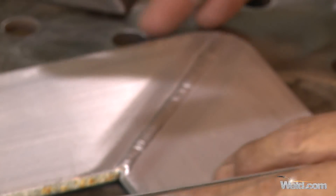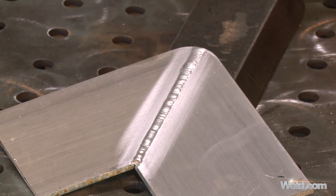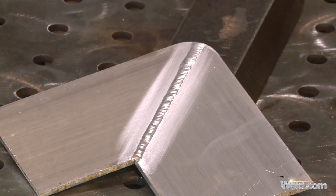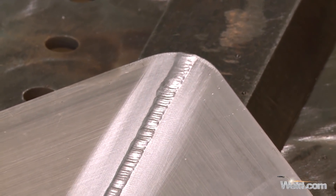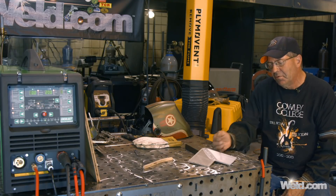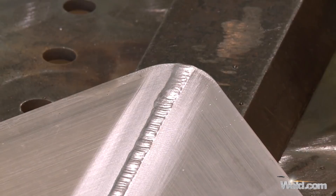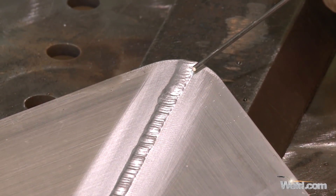I think I need to do this backwards and start out here on the heat-sensitive end. I ended it out there — I just apparently wasn't paying attention. I know that I did them the opposite when I did them before, but the camera guy had me all flustered wanting instructions. I floored this at 200 amps on the pulse out here and it looks like it's crowned up a little bit, and it's almost like I couldn't get off of it enough over here without snubbing the arc. Definitely I went backwards in my sequence and I apologize for that.